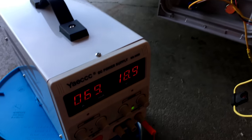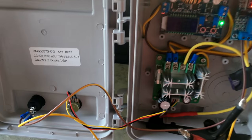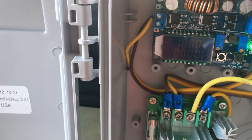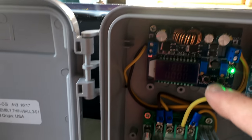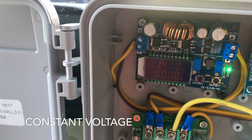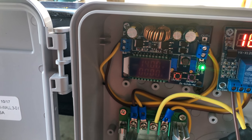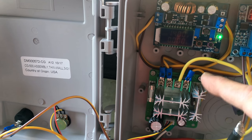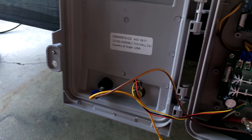There's 18.9 volts coming on the power supply, the relay reads 18.6, and the buck boost converter reads 18.8 — roughly all the same. The buck boost is set to output at 14 volts — that's the constant voltage. So no matter if the panel is producing 18 volts or 10 or 11 volts, it's always going to produce 14 volts, providing stable voltage and current for the PWM controller. Then I can fine-tune the motor off the potentiometer.